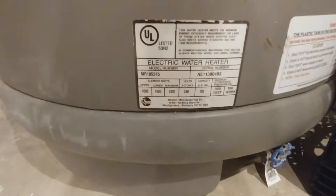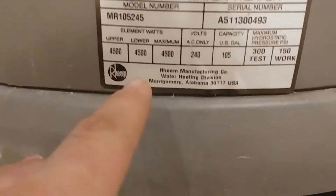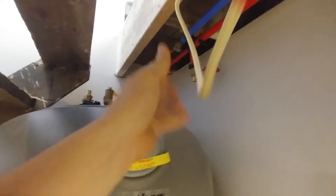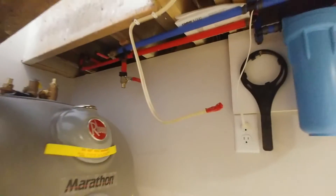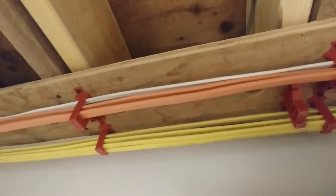You're also going to need wire. For a water heater that draws 4,500 watts — which you can see right here on my particular water heater — you're going to need a 10-2 wire. This one is white because it's an older style, but typically it would be orange, just like the wire over here for my dryer. That orange color is what they designate for 10-gauge wire, so you'll be looking for an orange coil of wire when you go to the home center.